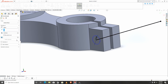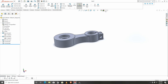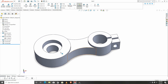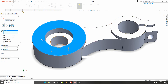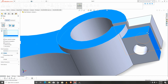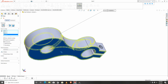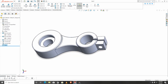At this point I will give fillets, then change to perspective view and white. I will apply my fillets and the fillets will be 0.5. Let me go with this part first and below. Next will be another fillet.